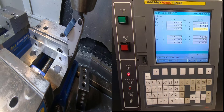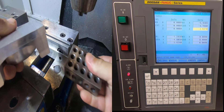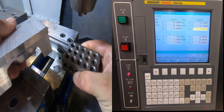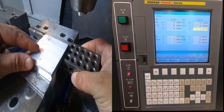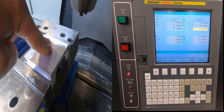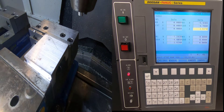I'm going to load my part into position so you can see how this works. I'll remove the dial test indicator. When loading, I put my 1-2-3 block against the actual jaw I edge-found off of — not too high or I'd be touching the wrong material. I lay the part on the parallels, push it back, slide it up against the 1-2-3 block, hold it in position, and tighten. That leaves it nice and flush.